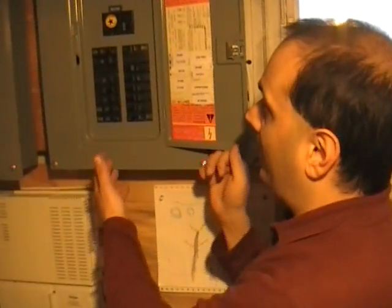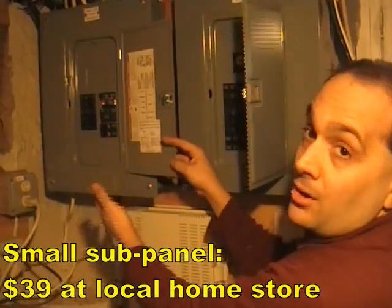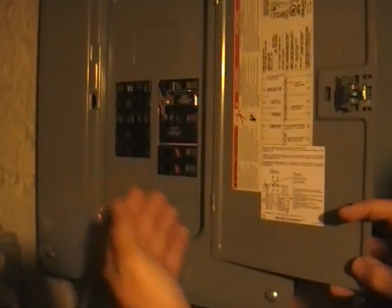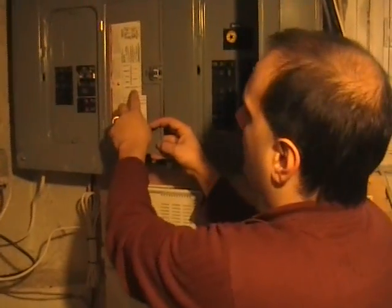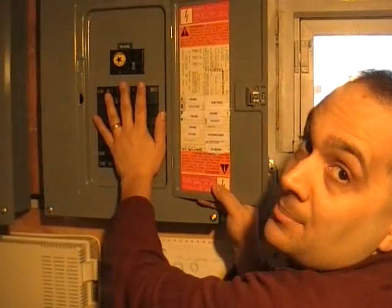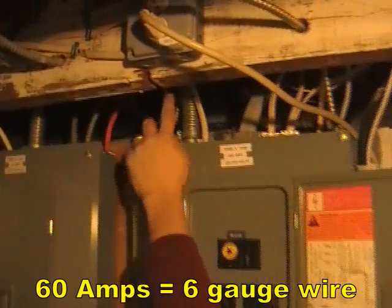The other way — and the way we went — is to install a sub-panel that can be transferred between utility power and generator power. The original panel that came with the house had 16 positions and was a little small, so we mounted a second panel and put all the circuits we want to run on generator power there: lights, the refrigerator, the furnace circulator pump, computers, bedroom outlets, TVs. Things like the dishwasher, air conditioner, and stove we left on the main panel. The main panel feeds the sub-panel using a 60-amp double-pole breaker, connected via a piece of greenfield conduit.